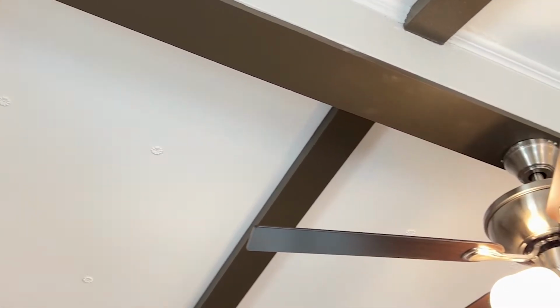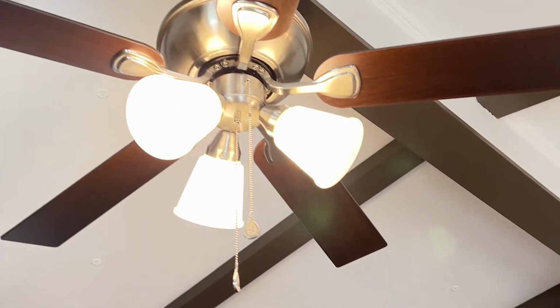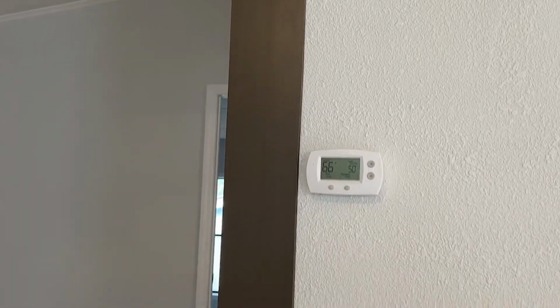To cover the screw holes, I used wall compound. You can also use wood filler, which might sand a little bit better, but I didn't have any on hand. After it dried, I sanded it until it was smooth, but apparently I didn't do a good job because you can tell where I covered the screws. But that's okay. I think it came out good overall.